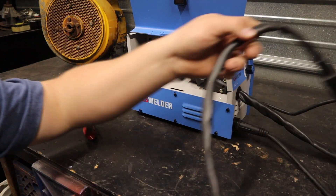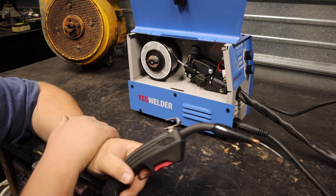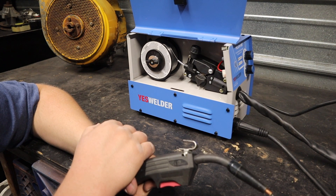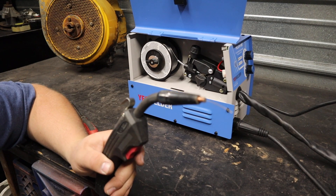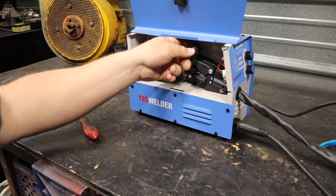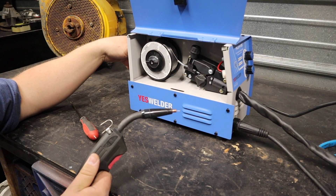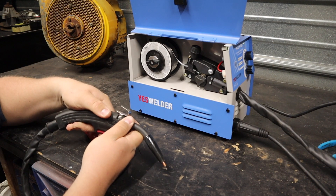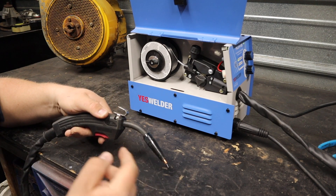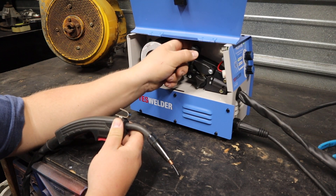Probably one of the more critical things is getting your wire tension correct. If you don't tension the wire drive mechanism correctly, you can damage the integrity of the wire. If it's too loose, obviously it's not going to feed. Basically what works for me is I turn my machine on and use my wood table. Get it all the way loose, then tighten to where it's about right. You'll want to get it pretty loose and then turn on the machine and run your wire into the table at an angle, so that if the tension is just right, it can start to swirl up rather than completely stop. That seems too loose, so I'm going to tighten it a fair amount.